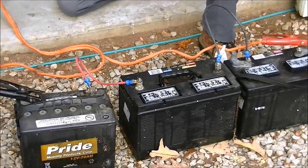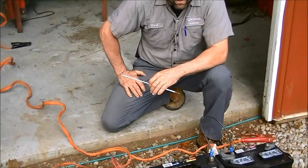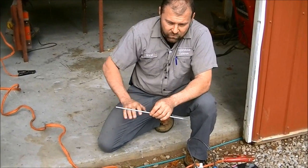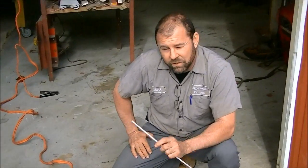We're going to take a 70-14 1/8 welding rod. It's going to be a little bit hot — it's going to be equivalent of welding with about 120 amps. This welding rod you really want to be around 100 amps, so it's going to be a little bit hot. But the metal we're welding has a little thickness to it, so we should be alright.